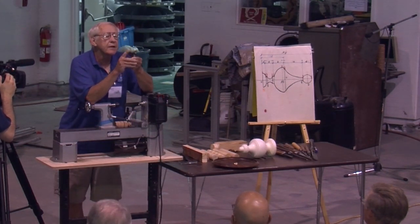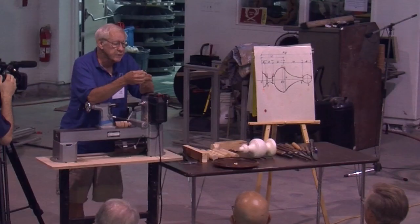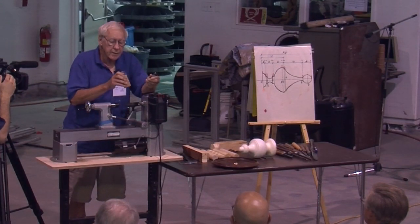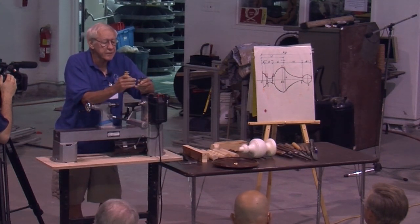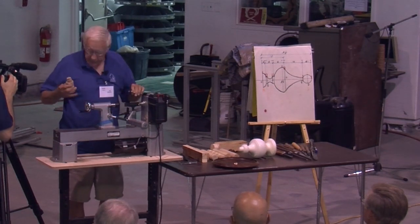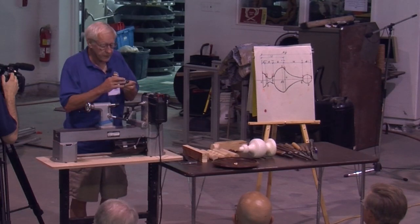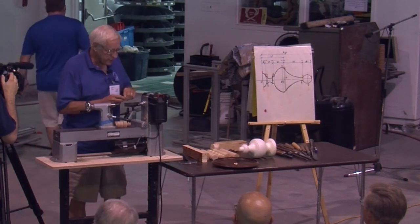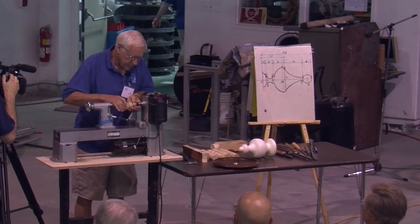The spur center has four points. If you take one of those points and make a little mark in it, so when you put it into your workpiece, it'll be slightly different than the other three points. It'll have a little mark in it. So if you take it out, and you want to put it back in there, that little mark will go in your piece of wood here, and everything will line up and it'll be exactly centered again. It's kind of a handy little deal.